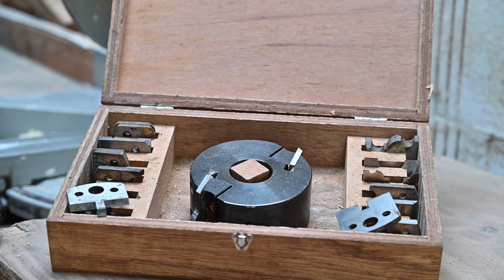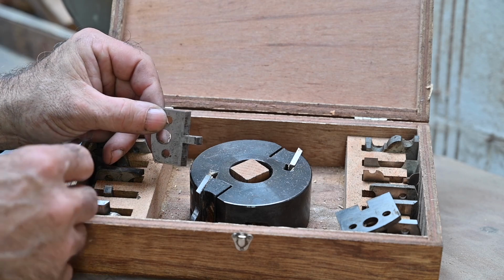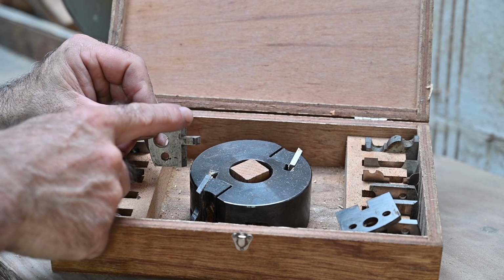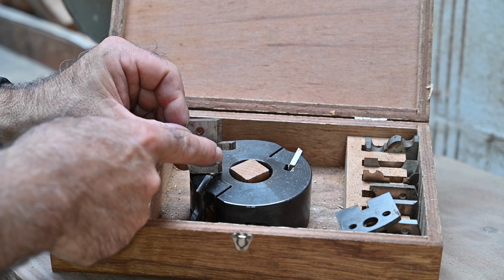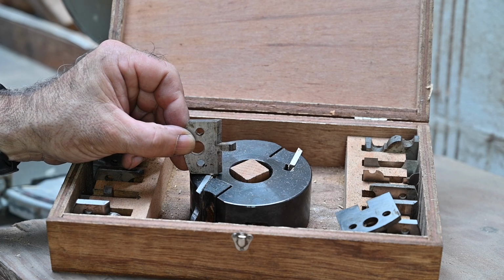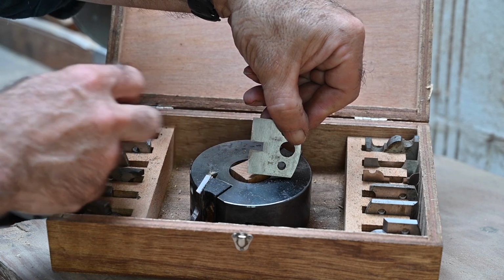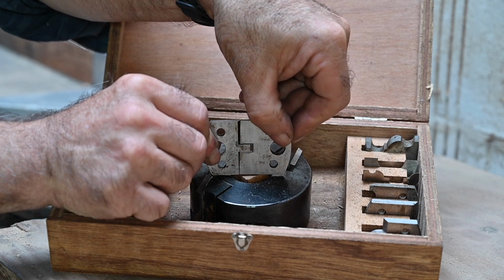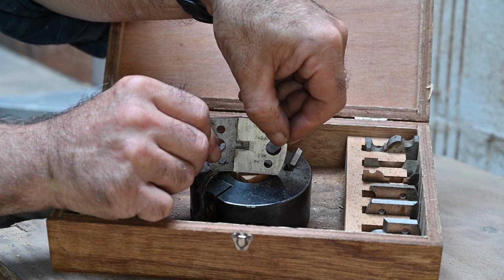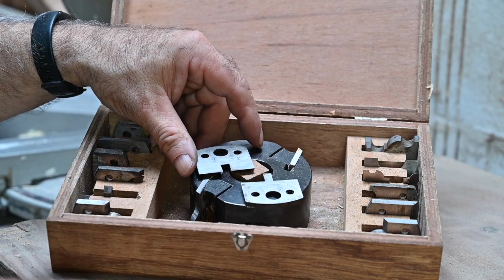When I refer to tongue and groove, this is nothing more than a cutout in a plank in the thickness sense that is going to cut out a sleeve basically, or a groove, and this is what you see here. This is the knife that will do it. Then on the opposite plank, we are going to apply a tongue to it, so a piece that will stick out, and this is the knife that we're going to use to cut out that tongue. Then the 2 planks can easily join together like this. So this is what we call tongue and groove. And I know sometimes I say teeth and groove, but I've been reminded that that is a wrong statement.